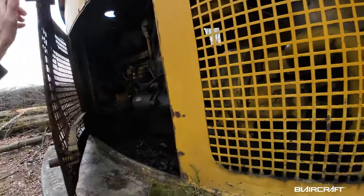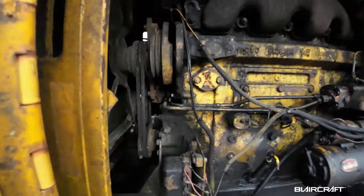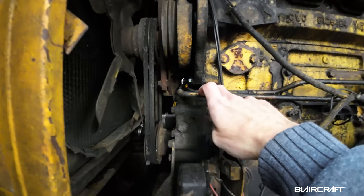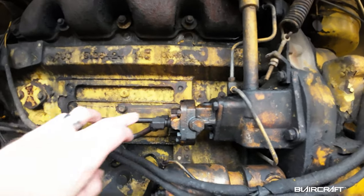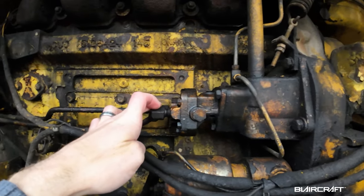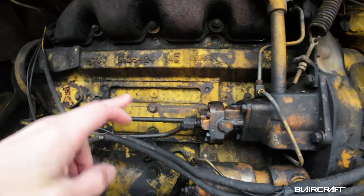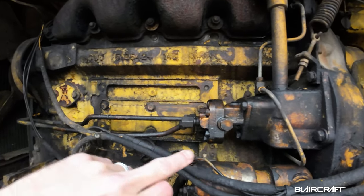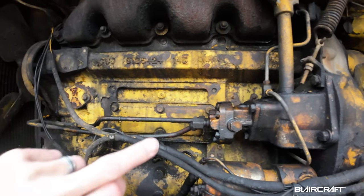Come on. There we go. All right, so you can see the fuel lines coming around right here, and I'll take a light and verify there's nothing in between there. But what we're gonna do is disconnect the lines right here at this housing. And then same thing up front, and one end I'll hook up a clear hose so we can capture whatever's in there, put it in a bucket and blow compressed air through it.